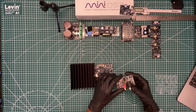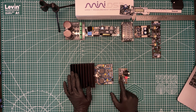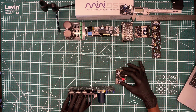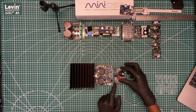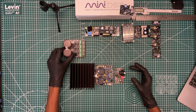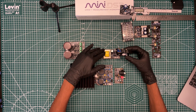There is a four-pin plug that jumps from the power section to the input board directly, so the power is provided from the power section to this as well — you don't have to separately power it. It's a plug-and-play setup that comes with wires. Power only goes in here with just one wire, and the rest is handled automatically. The speaker output wires are the only thing requiring soldering — they are provided so there are no loose strands and the output is not affected. It can accept up to 14-gauge multi-strand audio cable.